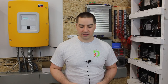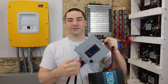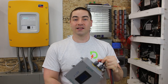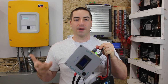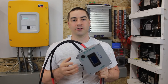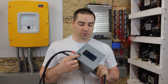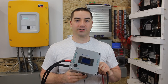There's one more meter I also want to test. I actually have two videos making this and this is the second version — it's a great meter. I have it attached to an inverter and I use it as a load so I can load test batteries and see their capacity. I really like this simple meter as a capacity tester when I'm building batteries. This meter was actually the inspiration for this video because I found it is reading amps about 7% low — that's why I've written 'times 1.07' on it, which is my correction factor.